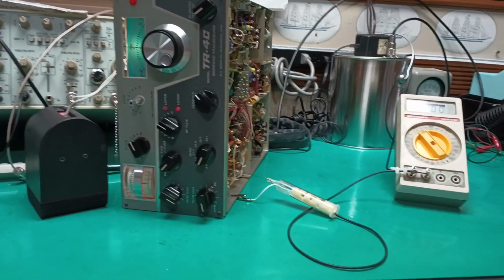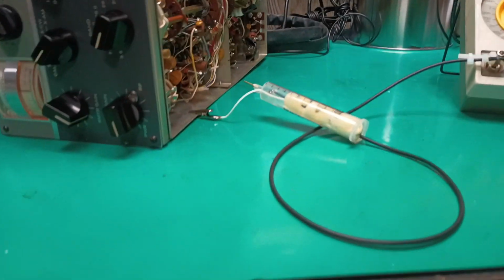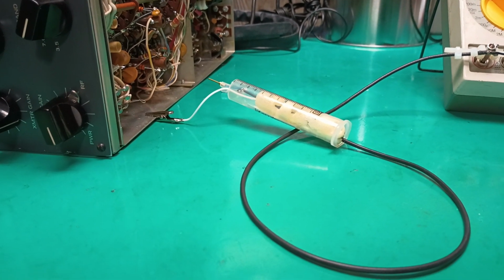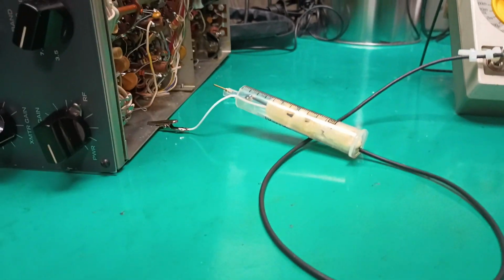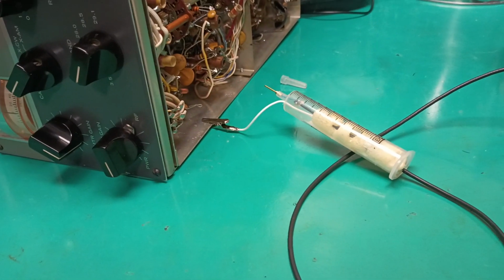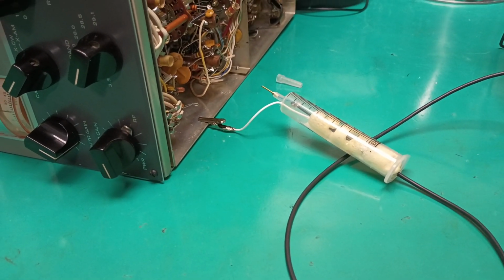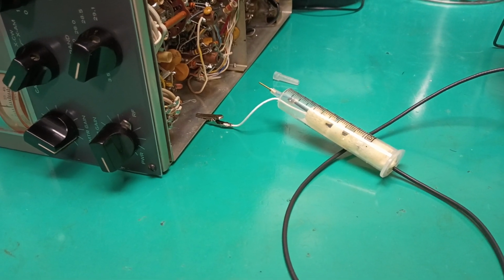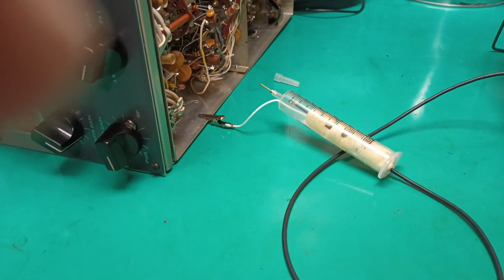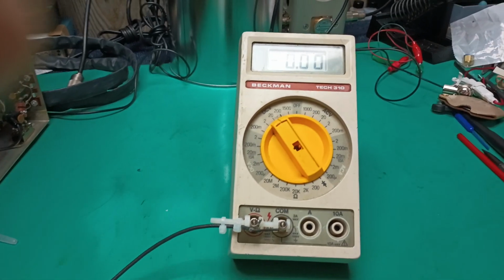So we drop back to old school with a new twist, and that's a microwave diode RF probe in a very low capacitance enclosure with a sinfully long ground clip for UHF, but it'll work on HF. Two microwave diodes, about 0.15 picofarad capacitance each. I doubt the end of that probe is seeing more than 2 picofarad. So a very good probe and an extremely expensive meter.